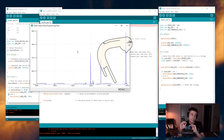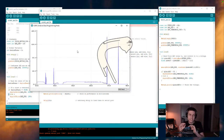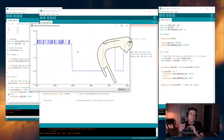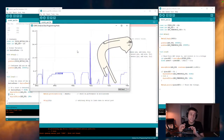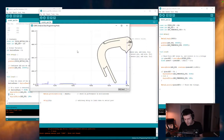It's just an arbitrary analog value, which I think can be a 10-bit number, so between 0 and 1024. And in this case, my signals are pretty low. In some cases, I'm just breaking 3 or 4 of that. So it's a very small percentage change, but it is enough to reliably sense. So I will just do a threshold and say, if this thing crosses this threshold, then turn on a light or hit a space bar or whatever. Should be an easy peasy thing.